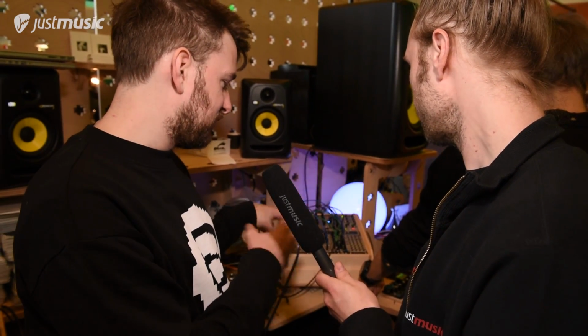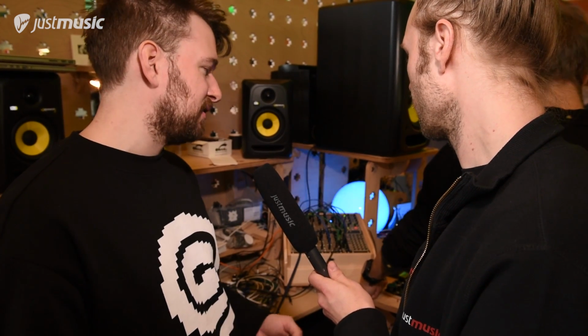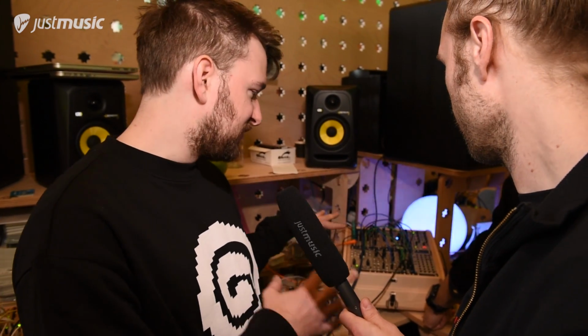So a lot of people have been requesting this version of the panels. So we've developed this whole new style, also the way how to make the panels. It's sort of newish. So technologically it was again quite a challenge. The wooden panels were very challenging, and then when we went to aluminum, we really wanted to make something special, and I think we've achieved that with a silk screen method that's combined in the process with the anodizing procedure. And so the color is really full and very durable.